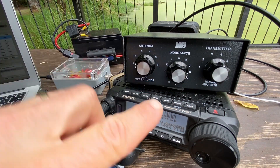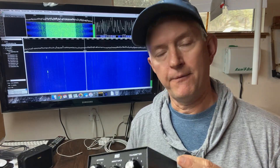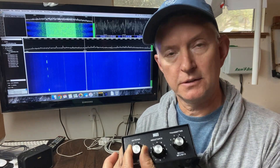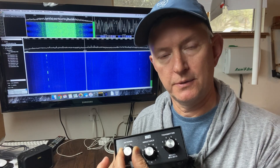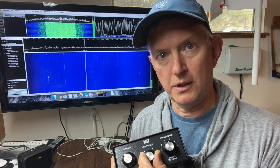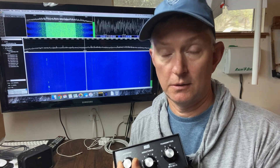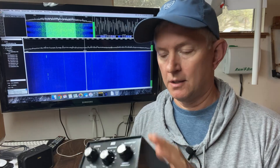You'll notice I only recorded the 20-meter band on my test. I found that the other bands were very similar; however, the lower the frequency, the less adjustment I could make — in other words, it was much more sensitive. Making changes to the capacitors, you really had to be spot on with the inductor and then make very fine adjustments to get the sweet spot for that particular band. This is a solid little box.